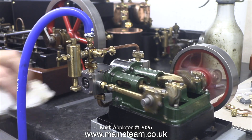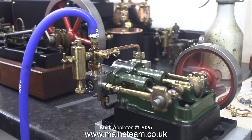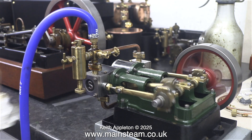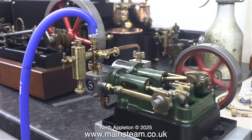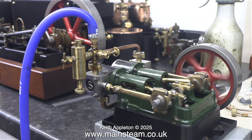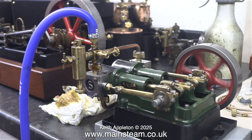I'm frequently cleaning the oil splashes off parts of the engine — this is not a problem, it's just for the video. If you rewind the video to the start of the running-in process you should see that the engine is running more smoothly and slightly differently than it did at the beginning. This is largely due to the fact that the slide valves are bedding in on the port faces, and now the engine doesn't sound quite as blowy as it did at the beginning and it runs very slowly indeed. This of course is slow motion from the video point of view, but the engine will run at this speed quite happily — in fact it will run slower than this.